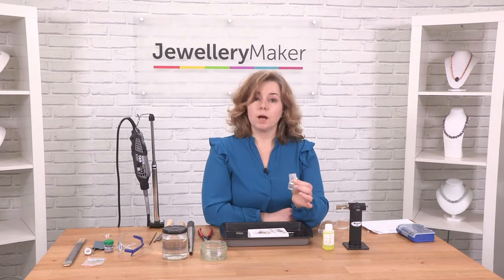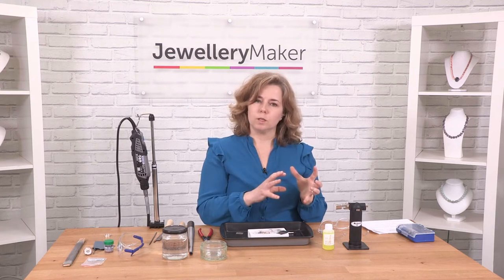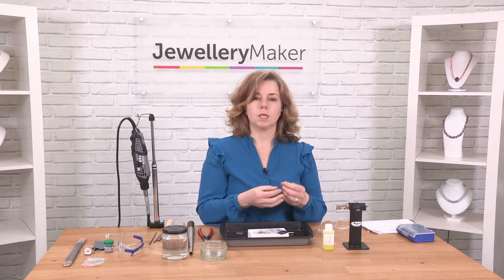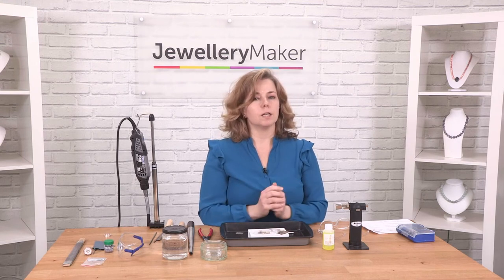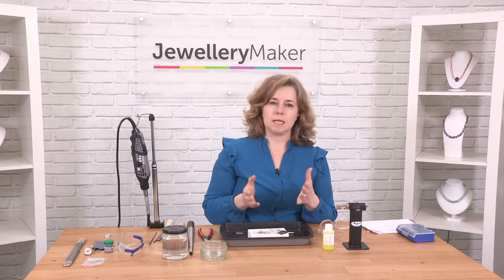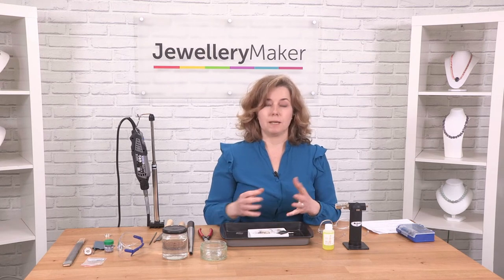The reason why different solders are useful is if you're doing something fairly complex in terms of soldering. You don't want your first solder join to run, so you'll start with hard solder — the strongest — then move on to medium solder, and then your final soldering join uses easy. You need to go in with hard solder first because it is your strongest, but that's not to say easy solder isn't tough. Anything soldered with any of these metal solders is a solid piece of metal once done.